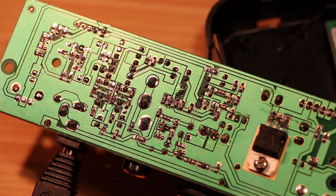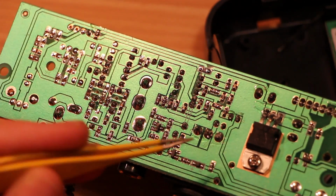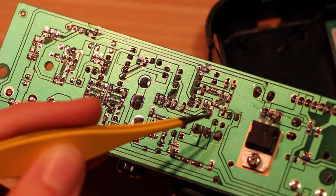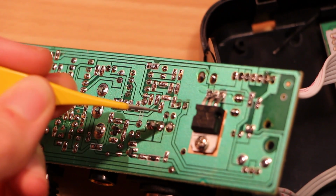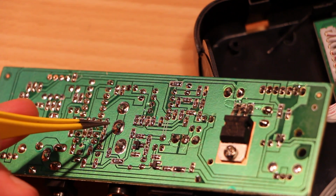I'm trying to figure out how this XLR output is wired, first of all. So we've got the ground on the right, and then a balanced audio pair here, and then these two little pairs are electrolytic caps on the other side. So this end of the balanced output isn't being driven, it looks like. It's just capacitively coupled to ground. This has got to be an auxiliary output.